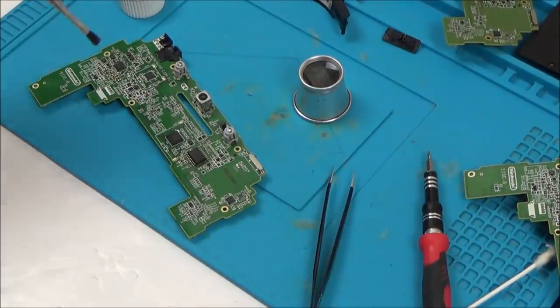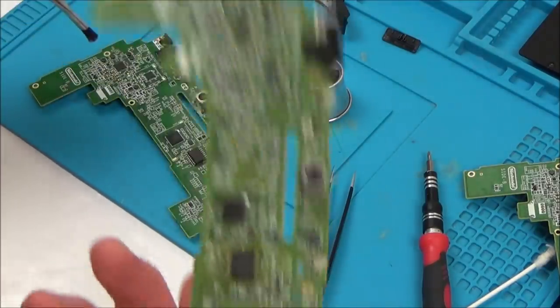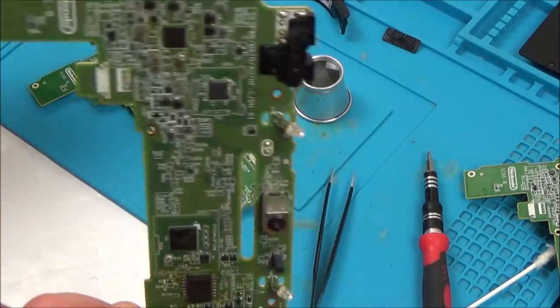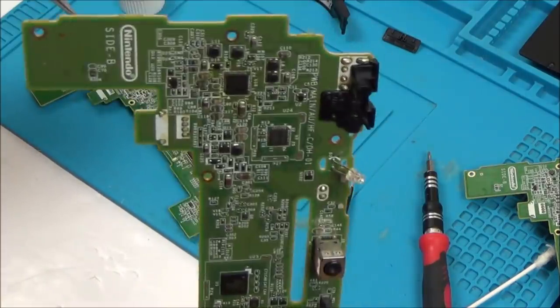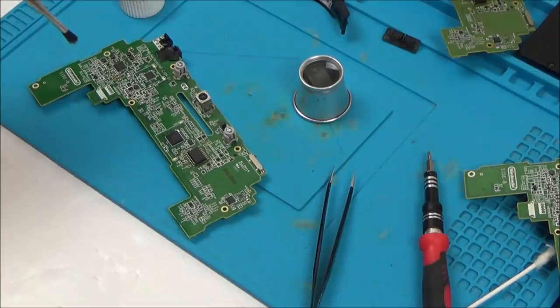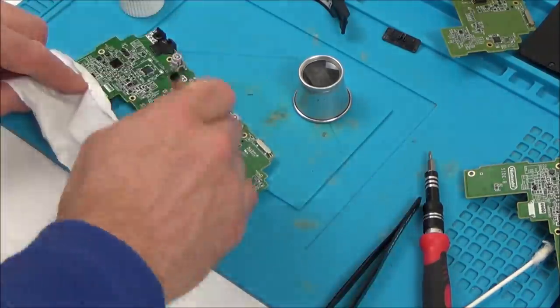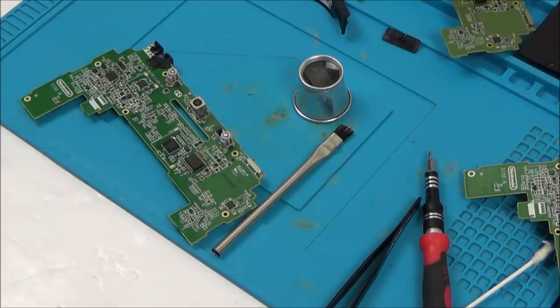I'm a bit disappointed. I mean, you can see I've got further, but maybe, let's just pretend there was some sort of lightning strike on the power line and a surge went into here. If it blew this, it might have taken out other components as well. I suppose I could go across every single component and see. That is an option, because remember I have got spare ones on here, but I still don't know what chips are married to the board as far as the region lock thing's concerned, because obviously if I take the chip off here, that is the American chip, and put it onto here, then I'm going to have the problem with having the region locked motherboard again. So I'll spend longer on it and see if I can uncover anything else. Working on it for a while, and I'll get back to the video when I've found something.